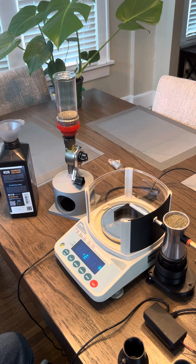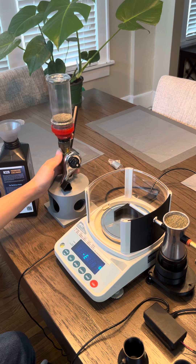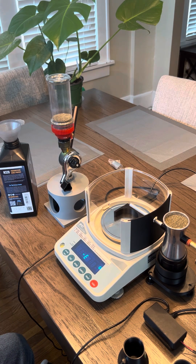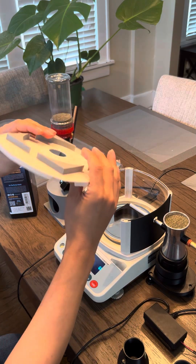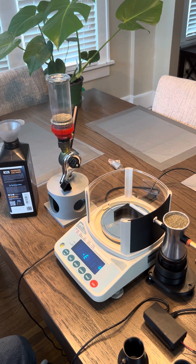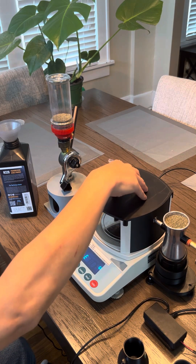So I decided I was going to include a bulk powder thrower. I wanted to limit my budget, so I went with just a cheapo Lee powder thrower — I think it cost me about 25 to 30 bucks. The major problems I ran into were: it needs clearance for the lever to be fully actuated, I needed to bring it up to a workable height, and the weight of the powder thrower itself is just not compatible with the original breeze guard top surface — it's too flexible. So I designed a reinforcing plate that sits on top to take all that weight off.